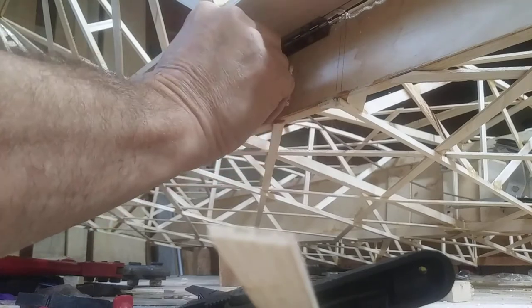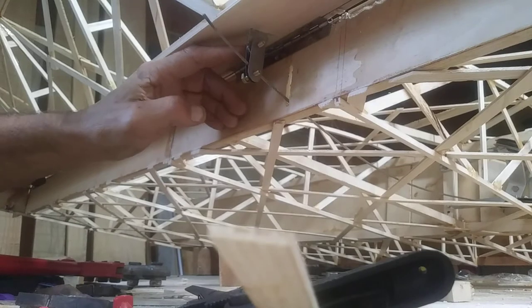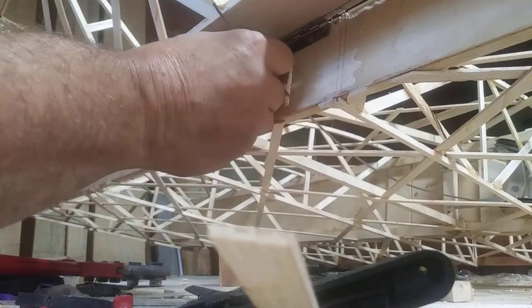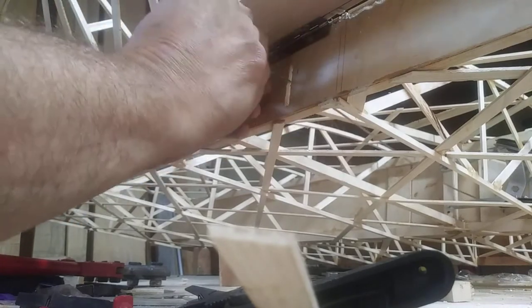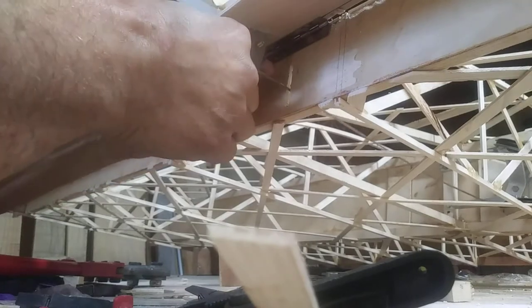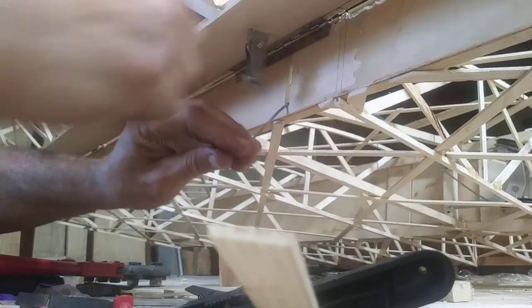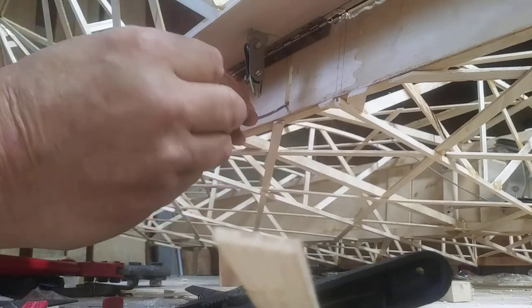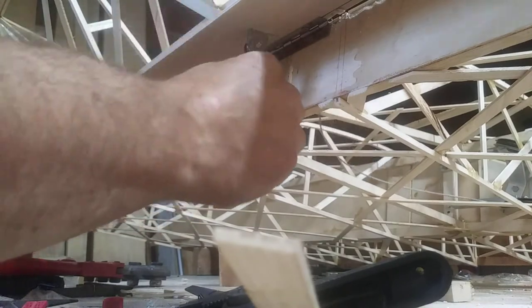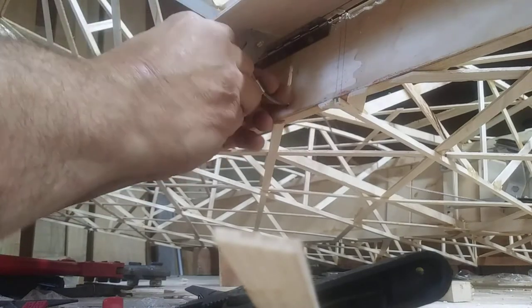Some people connect directly to this with the cable, but then that requires you to pull the cable all the way through the wing any time you want to remove the aileron or work on it. So you always want to use a wire thimble — cable thimble. And of course, the same thing I always do: I didn't put the swedge on before putting it up through.